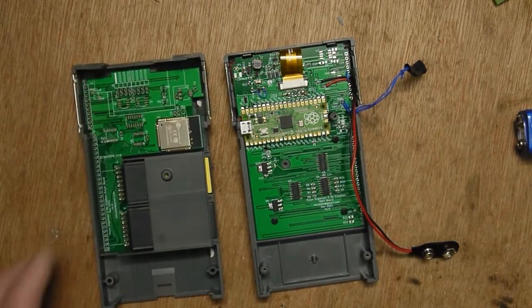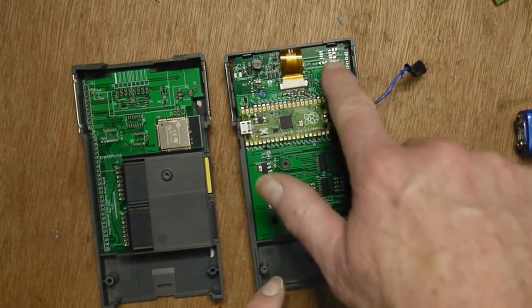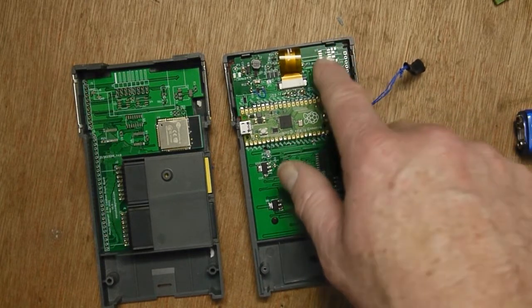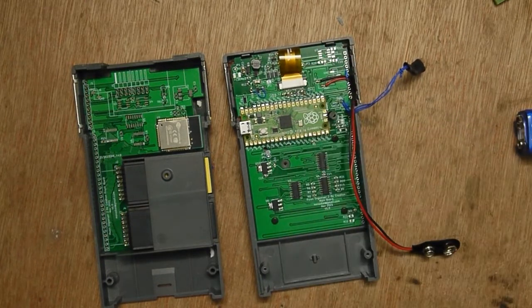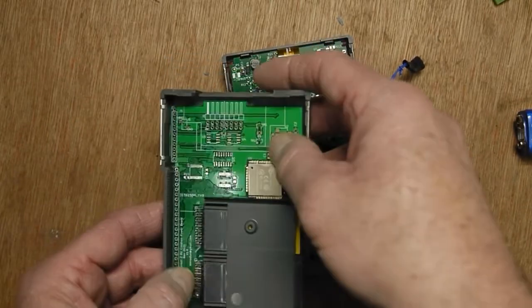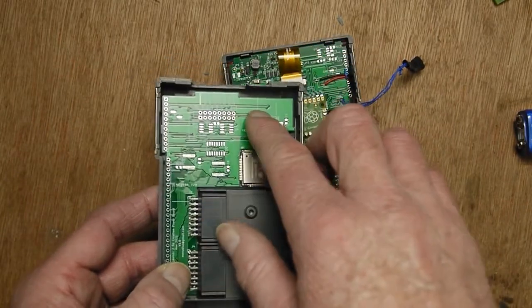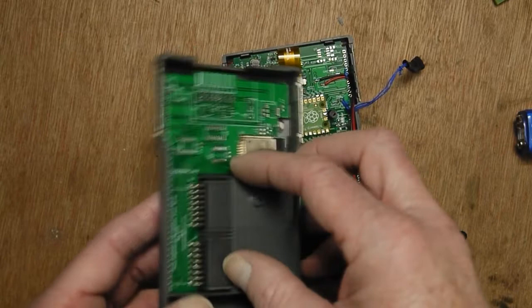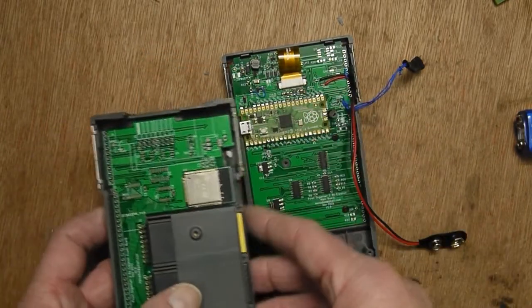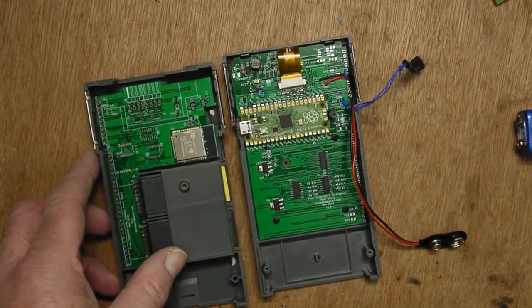Yeah, so quite a bit of code now and a little bit more populating of stuff. This up here is the real-time clock. Unfortunately I don't have that entire chip in the particular footprint I put down, so I can't actually populate that at the moment. I haven't bothered doing any more of this. The top slot I think fits. These connectors for the data pack and top slot need spacing off. They're not actually the same as the ones that the original Organiser had.